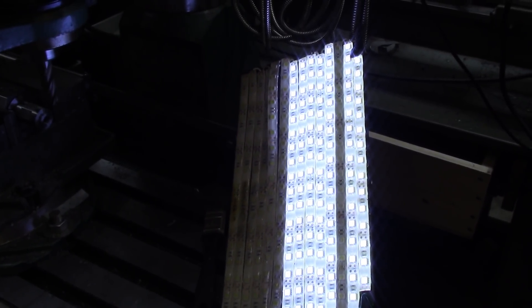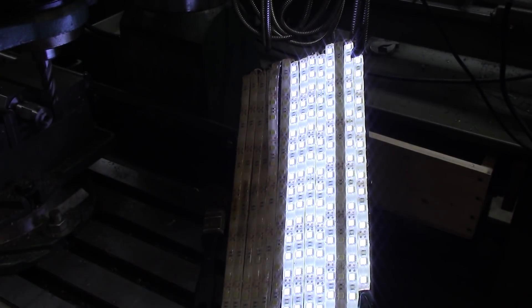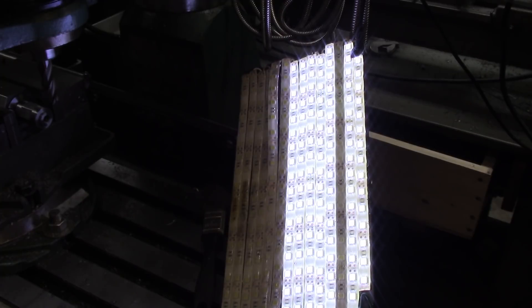As you can see, only half of them are lighting up. Some of them are coming unstuck. The problem is, of course, because I don't have a good solder joint on the darn thing. Not sure why this one's not working when stuff on either side is working, because it's all in a series.